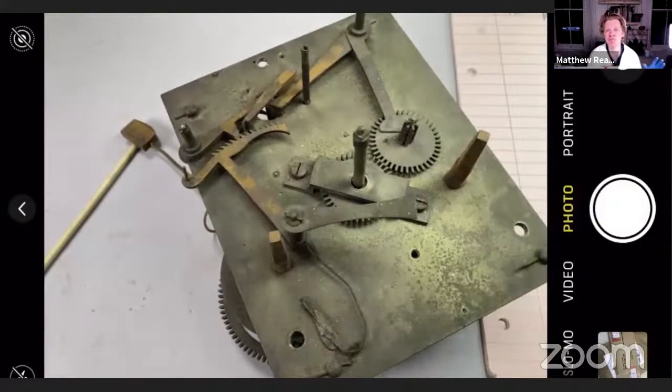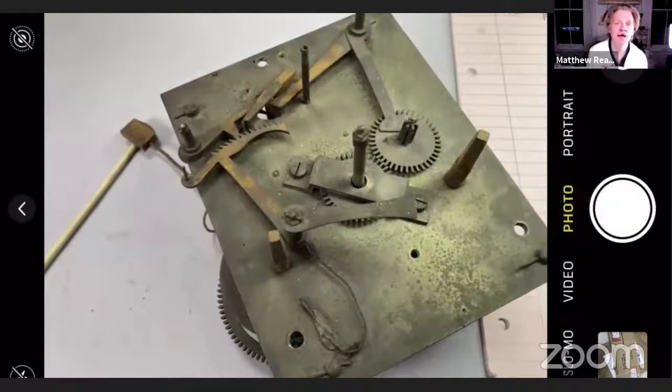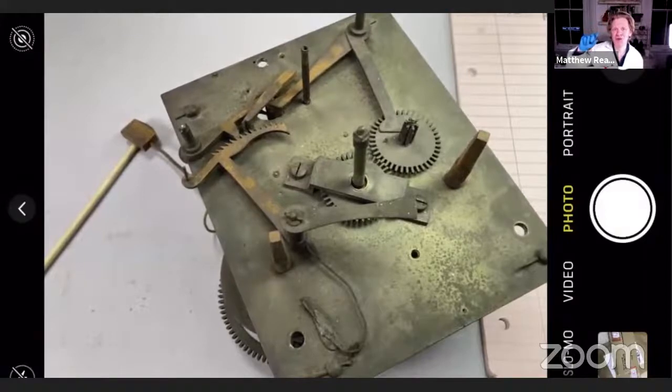However, from one perspective, punching it a little bit, of course, you're not removing all that material that you have to when you put a bush in. A bush is seen as a repair process, but it's actually also a destructive process, because you can't insert a bush without actually reaming or broaching out some material from the host plate. Now, those little spring-loaded punches that we call knurling punches that come in sets, I think they're a kind of post-war, mid-20th century thing that you would get from your clock material dealer. So I think the punching goes the whole way around the pivot.